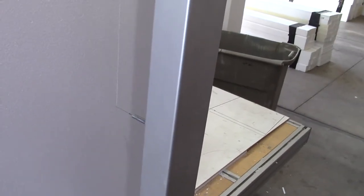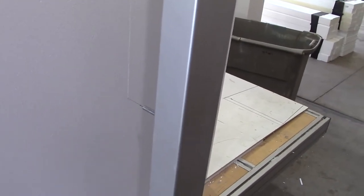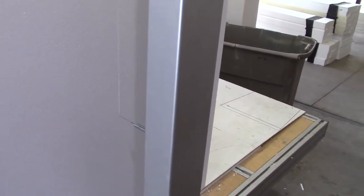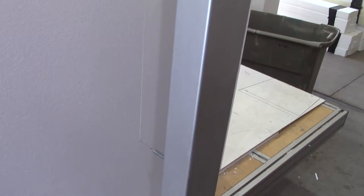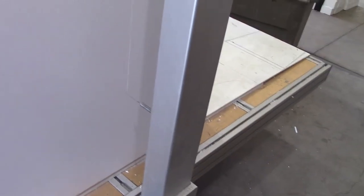Here's Gracie doing her thing, and I program to about a hundredth of an inch and anticipate the wire burn. Any of you that have used a table saw know what a kerf is. Well, the wire has a kerf, usually about five hundredths. But anyway, this hole will not be close, it'll be perfect. And it's all based on the rough opening size of an LG 12,000 BTU window air conditioner.